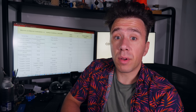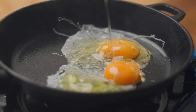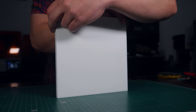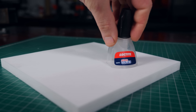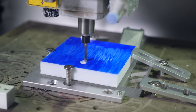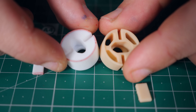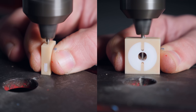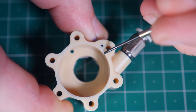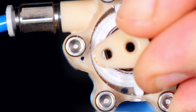The solution is to find a low-friction material. I found a table online with coefficients of friction for several materials — the best one is ice, which would be funny but wouldn't last long. So I went with the second best: polytetrafluoroethylene — a fancy name for Teflon, the stuff in your non-stick pan. I bought a block of Teflon for 30 euros. It's not plastic, it's white gold. Nothing sticks to it — not even glue. My CNC machine went through it like butter. I now have vanes and rotor in Teflon, with 3D-printed jigs to drill the holes. I also added a flap valve at the apex made from a 0.4mm Teflon sheet, which uses leaking air to seal itself even better.